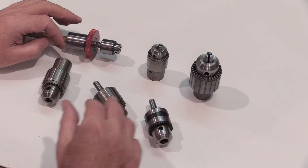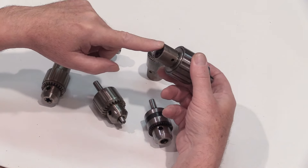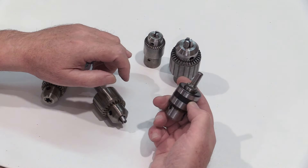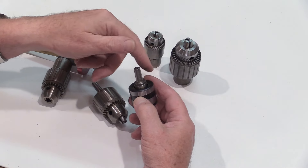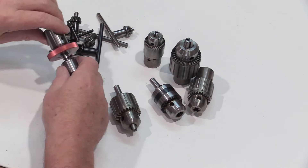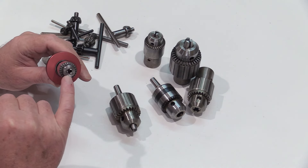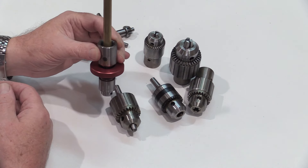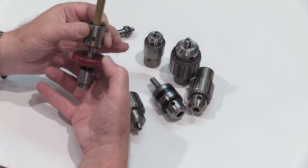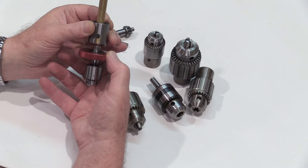I went a little crazy buying drill chucks — I think I have every one that Sherline makes. With the appropriate adapter they mount on the mill, and with the morse taper adapter they mount in the tailstock of the lathe. The adapters come right off and you can swap them around and use them any which way. This little item Sherline calls the sensitive drilling attachment — it's made for holding tiny drill bits like your numbered bits, mounts in the spindle of the mill, and it's spring-loaded. This allows you to feed the drill bit into the work piece as slowly as you like, which is great for working with tiny bits so that you don't snap them.